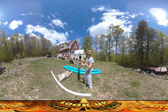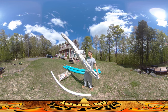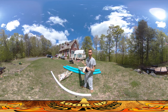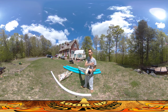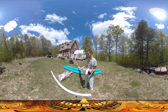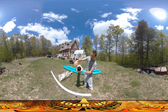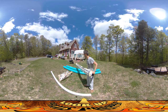This is what I'm turning the pipes into: I've got the pipe in the middle with about an inch to an inch and a half of urethane foam all over the outside, and then spray foam gluing it together. The pieces of foam are actually scrap from my first homestead — some of this stuff is like 15 years old, some is scrap from making the storage shed at my last homestead. I kept all this stuff in bags, and it was absolutely perfect — I had strips ready to go, laid them down, duct-taped them all around, and then did spray foam along the edges. Now it's a nice rigid pipe.